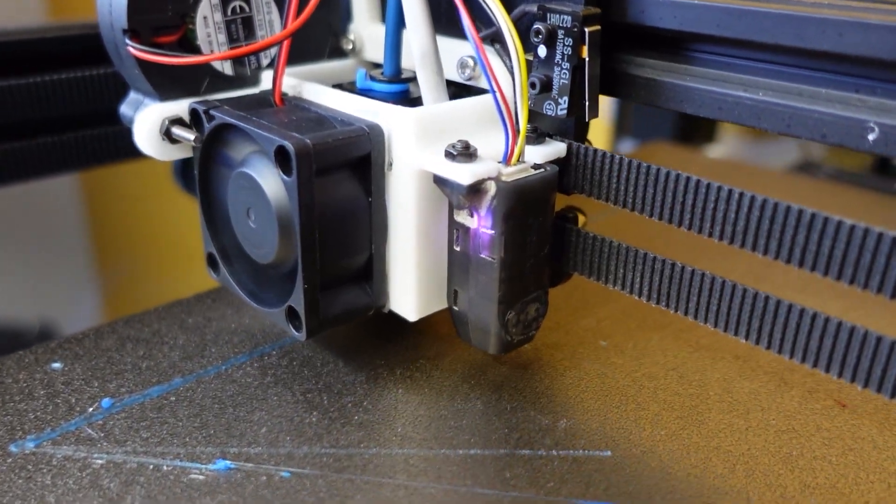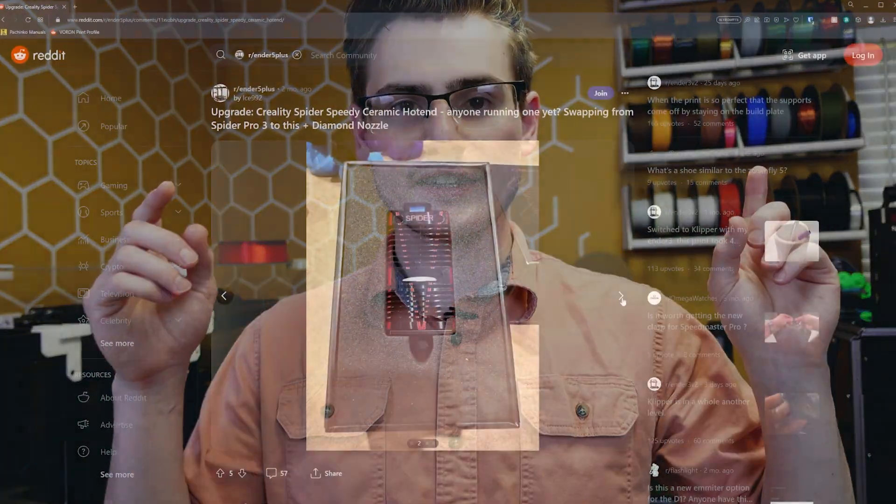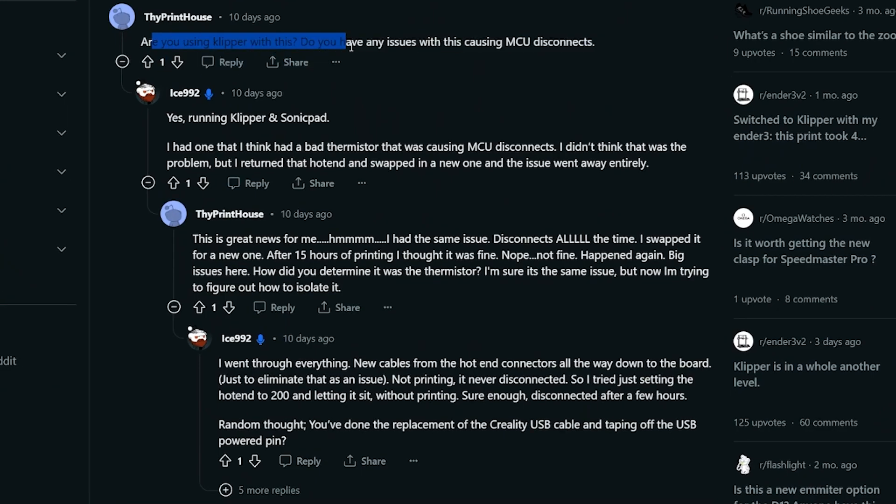For those who don't use Klipper and don't know what an MCU disconnect is: basically the entire printer shuts down. Power is still there, but Klipper has disconnected from the motherboard and any active print is forcibly shut down — the connection between your Raspberry Pi and your printer, or your Sonic Pad, or whatever your Klipper host is, is completely severed. For me the error happened anywhere from literally five seconds after I clicked print all the way to 45 minutes in. I was able to print full benchies sometimes, and other times I couldn't even finish the purge line. I found a Reddit post — it's on screen now with a link in the description — showing other users having the same issue with this hotend. After all the many hours I've put in, I can solidly say this is not an issue from the user's standpoint.